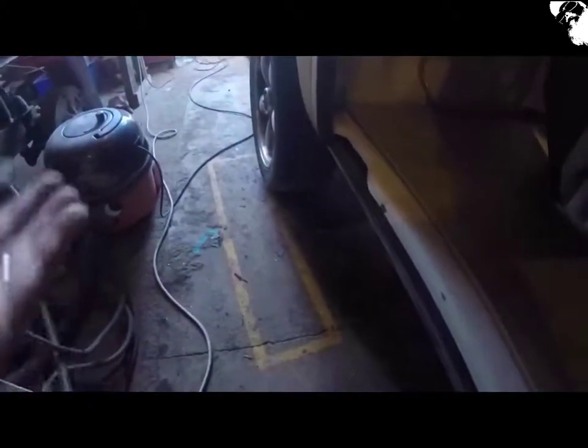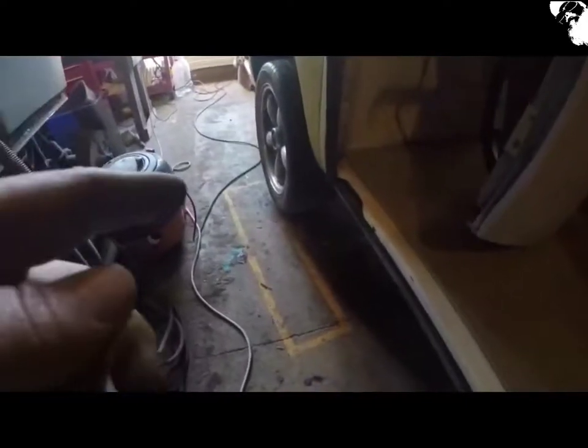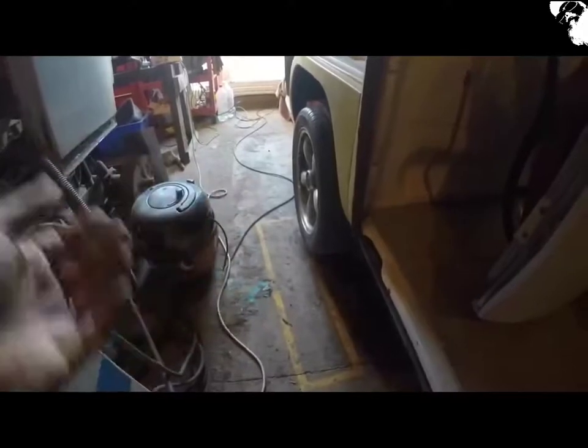While I'm working on that, in the corner of my eye I still had a puddle forming around that front tire. I had a bit of rain, and the floor's now dried out from me walking the wet in and out — but underneath that tire it's still wet. So yeah, that's brake fluid. When I'd done the brakes in a previous video, I didn't actually adjust the two front brakes. I don't remember greasing those needle bearings up either — that's when I was going to do it. But now I'll probably do it sooner than I thought.